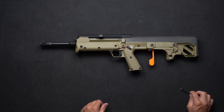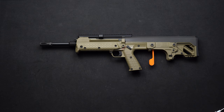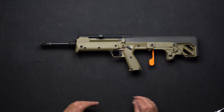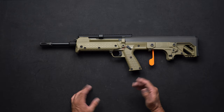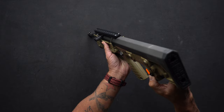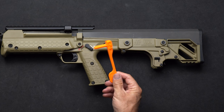Let's field strip the RFB. First things first — safety. Always put safety glasses on, as you'll be dealing with some spring tension when breaking down a firearm. Next, make sure there's no ammunition in your workspace — keep your ammo in a completely separate room. In our studio we have no live ammo and there's a chamber flag in the gun. To remove it, put the muzzle down, push up on the bolt stop, and pull the charging handle back to lock the bolt in place, then pull the chamber flag out.